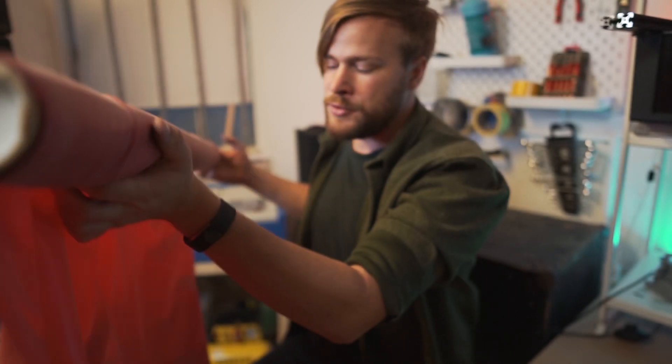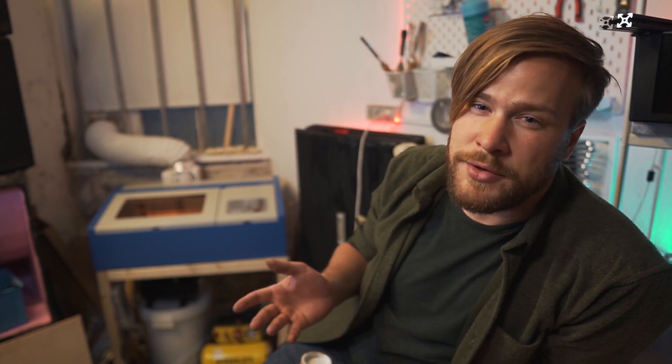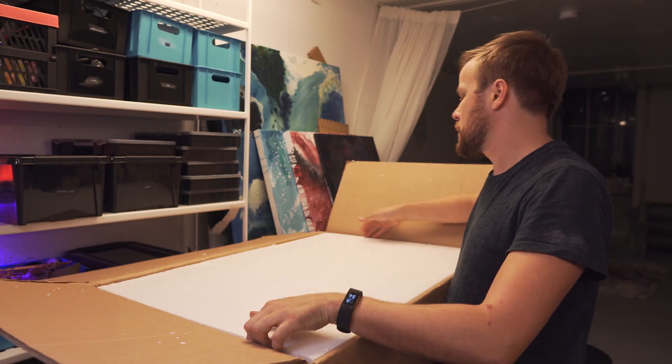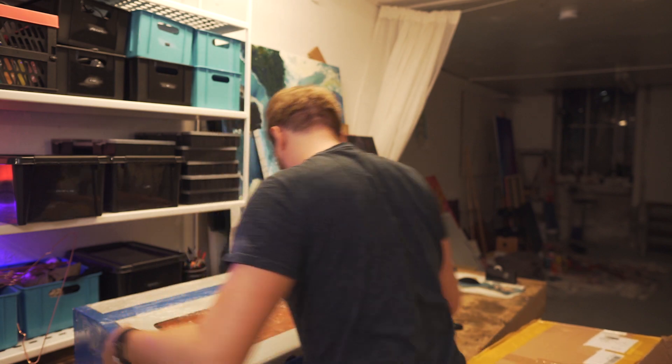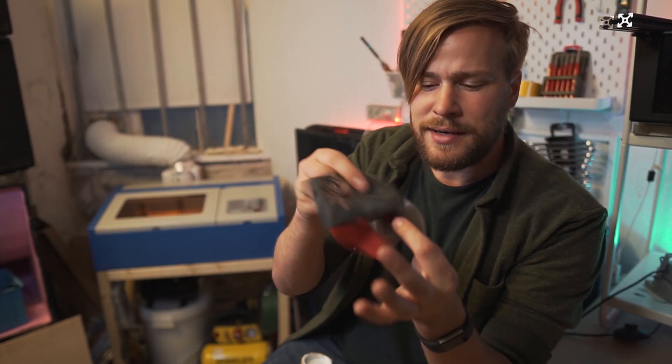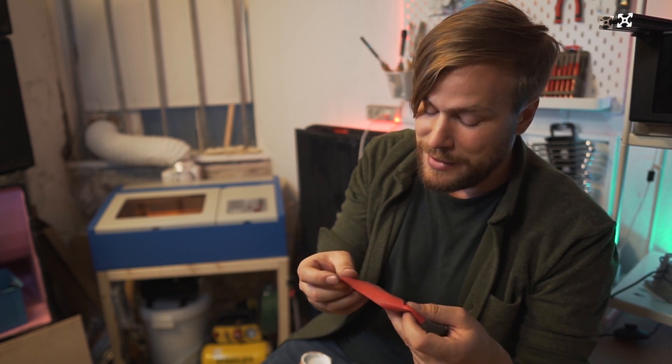For latex I used 0.3 millimeter material. The laser I'm using is a cheap Chinese K40 cutter — it runs for about 300 euros or three hundred dollars. All I've added to it is basically air assist, but to be honest on loose latex that made it worse since it kind of moved the latex around. So not ideal, but if you use the painters tape method then it's nice to have but totally not required — a standard cutter will do just fine.